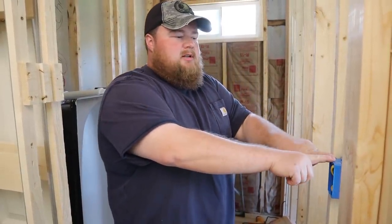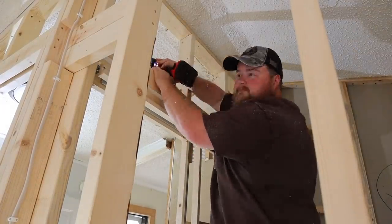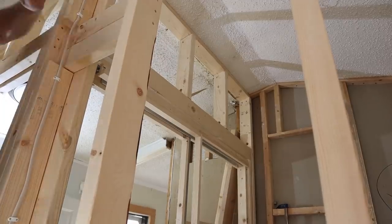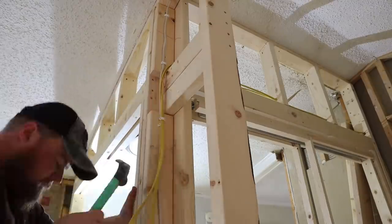In here in the bathroom, we did more electrical work. Kind of walking backwards. Originally, the bathroom door swung this way. We obviously put our pocket doors in here. And so the light switch that was originally on this wall, we could not put it there because we have a door inside the wall now. What we decided to do is put the light switch here, which meant running the wiring up and over and doing kind of a loop. The power comes from this way, comes over to the box, and then goes back over to the light. So it was a little bit wasteful for wiring, but overall it gives a good layout and flow as far as flipping the lights on here but still having the lights above the sink and everything.